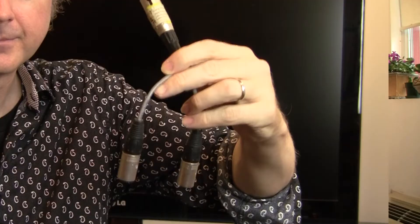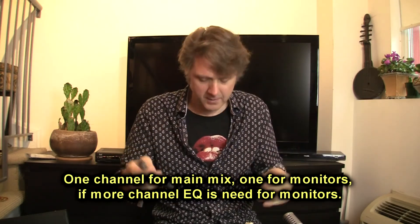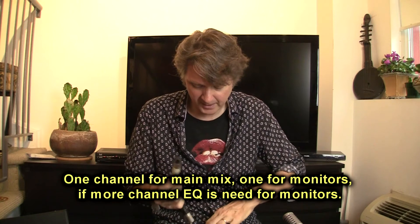I've got this thing which has saved me many times — it's a simple XLR splitter. I can split a microphone into two channels or split an output into two different sources. I've used it for a microphone going into a video camera that needed two inputs but only had one microphone and one mic cable, so I was able to split into two different microphone channels at two different levels. I can also split a microphone input on a mixing board into two different channel strips for individual control. There's no one situation — there are many possibilities.